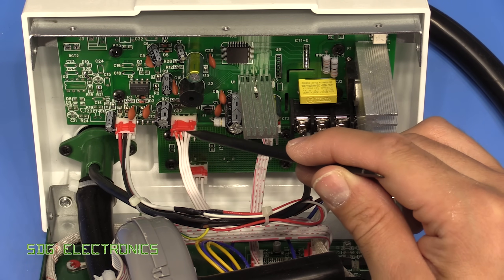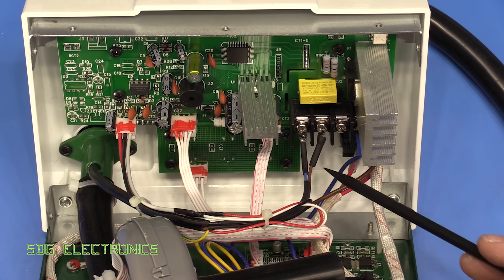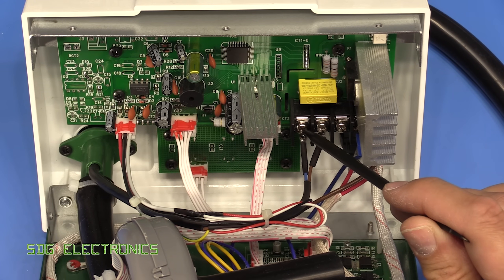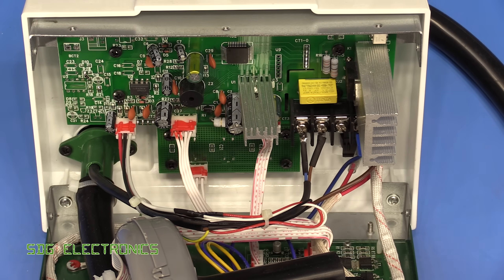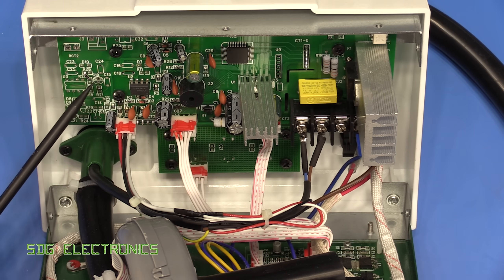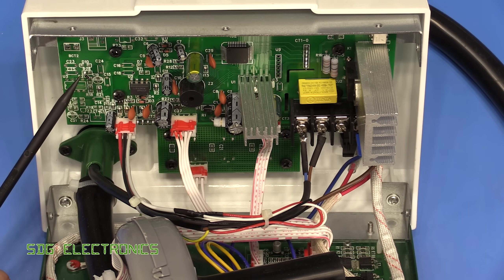The overall construction doesn't look too bad — all cables are tied up, everything is heat-shrunk so they don't get caught up or in the way, all the connectors are glued together so they don't come falling out, and the terminals are heat-shrunk and connected nicely onto the screw terminals. There is a zero ohm link bridging out two pads here, presumably to disable some electronics that might be for a different version, but that is actually soldered between two pads.